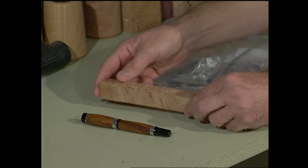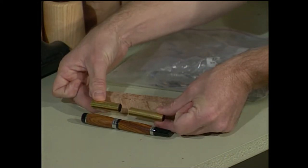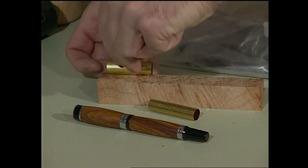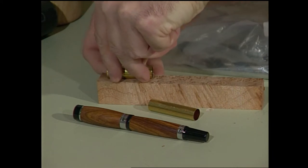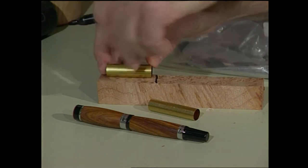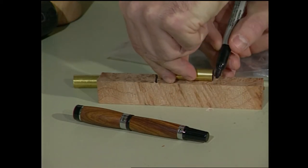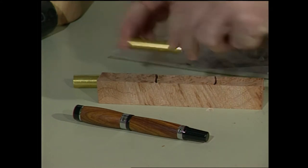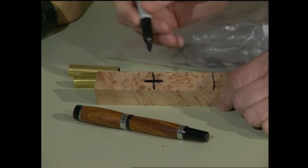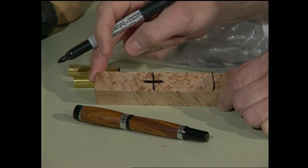The first thing we have to do is grab the bushings that make up the pen. These lie in the pen just like this, and the bushings are what you build and base the whole pen off of. All the parts press fit into the brass tubes. I want to lay this out on what I think is the best looking part of the wood, leaving a little excess on the end. The most important mark you can make is this line right here, because when we cut this apart we're going to lose these lines. By making this mark, we'll be able to match up our grain and that'll make the pen look really nice.